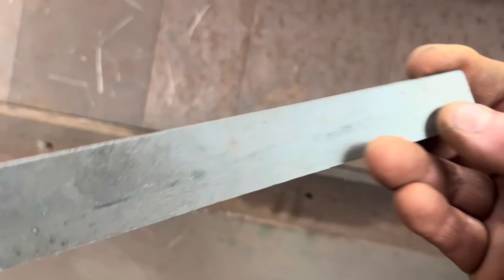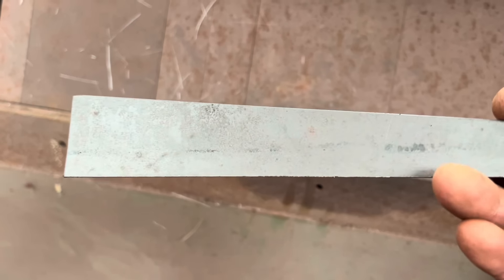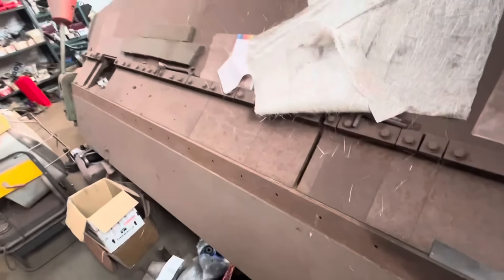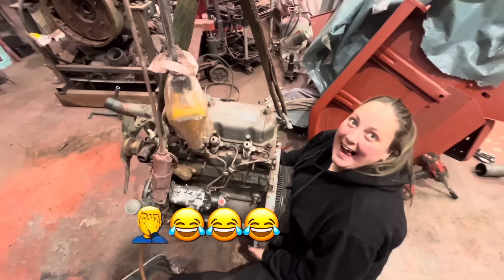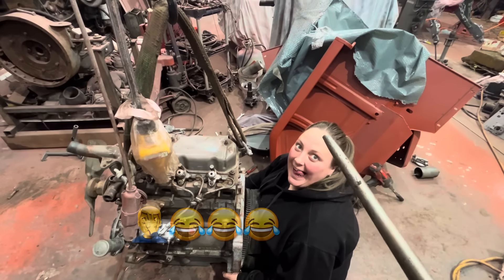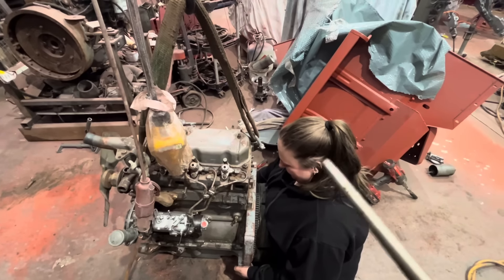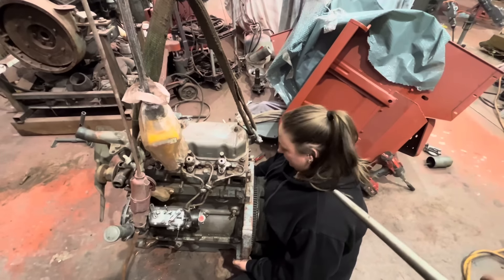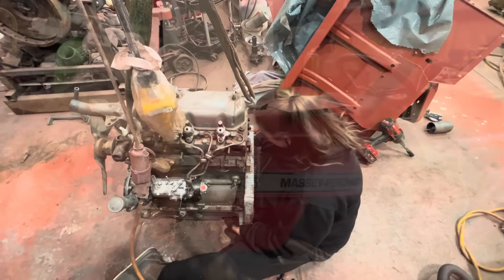It's a little bit two-mil for the bottom battery box but it ain't gonna fit in the other one without changing all the tooling, so we'll go upstairs and use this one - an old school box pan folder, all the fingers removable - so we'll get this one bent up in this one. You really need to shove it in the hole and then get a bolt lined up to go in the other hole, so you've got to make use of every hole to make life easy for yourself.